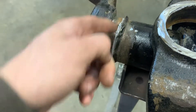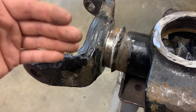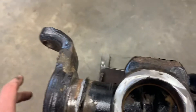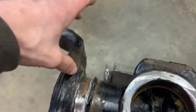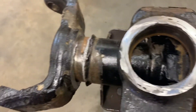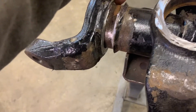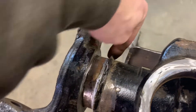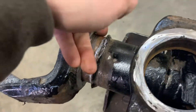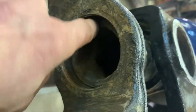Then you go down in there. Once you feel as though you're to a good point, spin this around. Use the top of the inner C seat first because it has a larger flat spot to hit. Hit that maybe three or four times, and hopefully what you're going to see is right on this top side, you'll start to see a crack forming. Then you'll kind of see it on the inside where the inner C will start moving out.